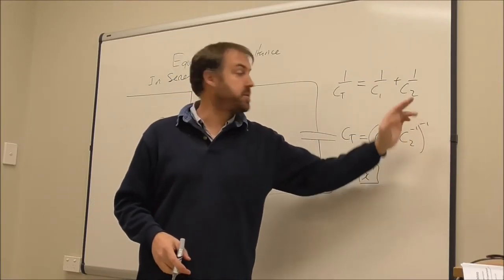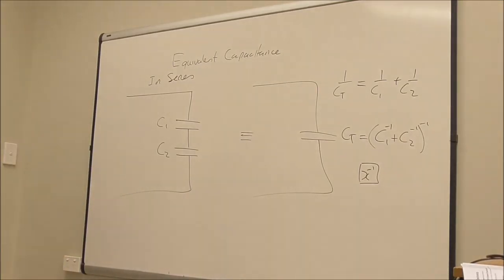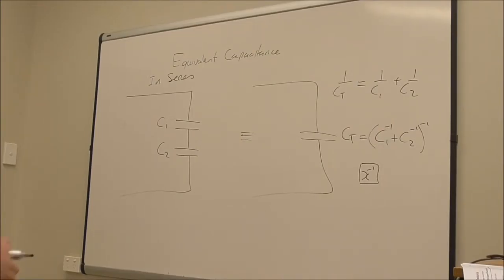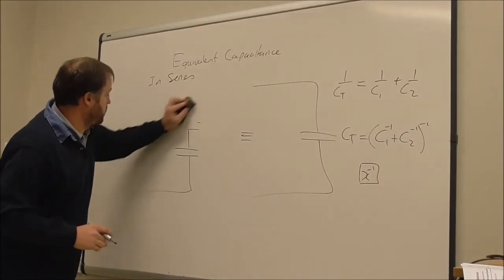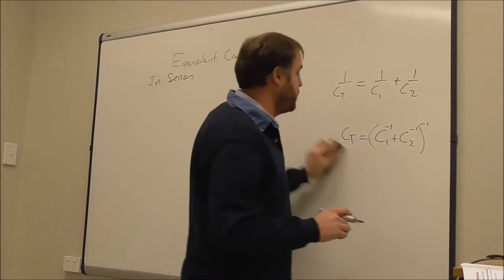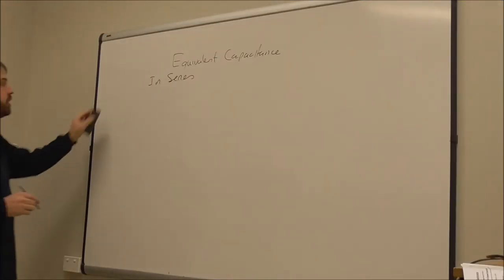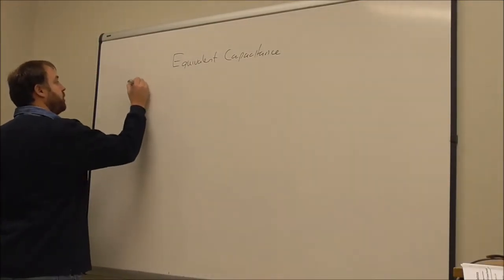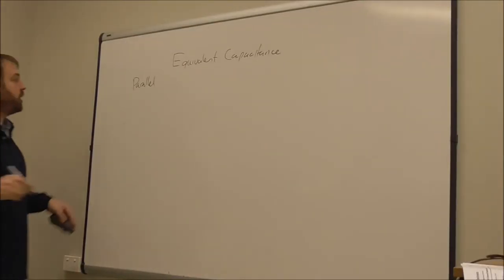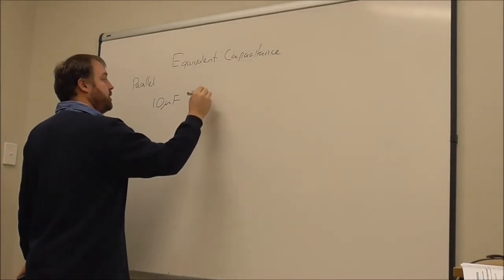Actually, I'll do a couple of examples of that. 1 microfarad plus, let's say, another microfarad. Then I can just go 1 to the minus 1 plus 1 to the minus 1, close the brackets, and then make sure you do the minus 1 again at the end, okay? That reciprocal thing there. So let's do a couple of example questions together. Let's do them in parallel first, for different values.